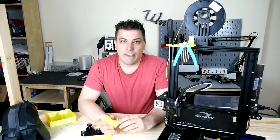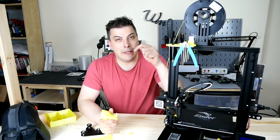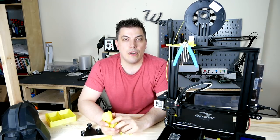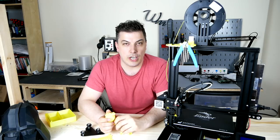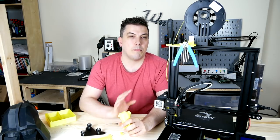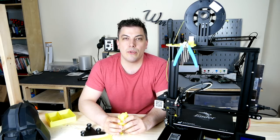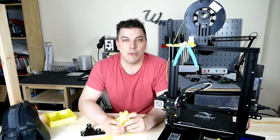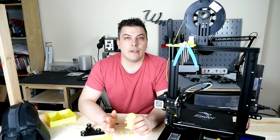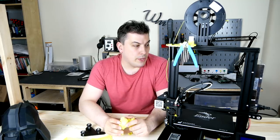I will just give you my initial tour, and if you like, please leave a comment down below and I will do a follow-up video. I'm planning to do some changes on the printer such as a firmware upgrade, putting Marlin on it. The printer is not coming with a bootloader, so a USB ASP will be required. I'm planning to do a guide and a follow-up video on this. The printer has been printing every day.